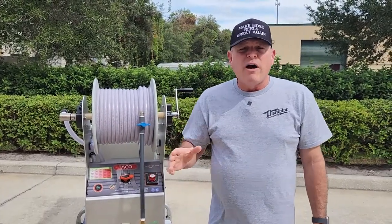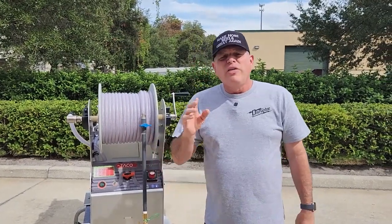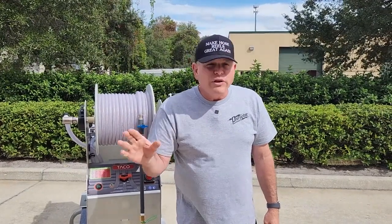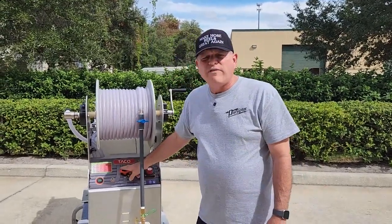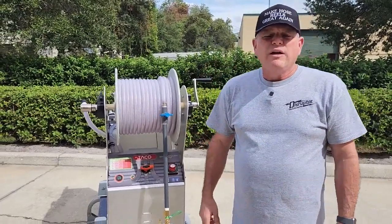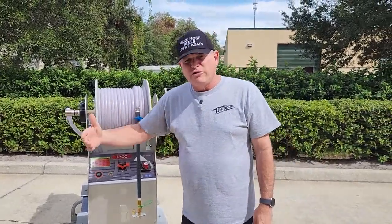The water valve, as well as the soap, are static. The water, you don't have to set a valve, and the soap will always perform at 2 ounces per gallon. Always at 2 ounces per gallon. So the only choices you're having to make on this system is this one metering valve, and you're using this chart to make your setting for your bleach so that you can clean different surfaces at different bleach concentrations.